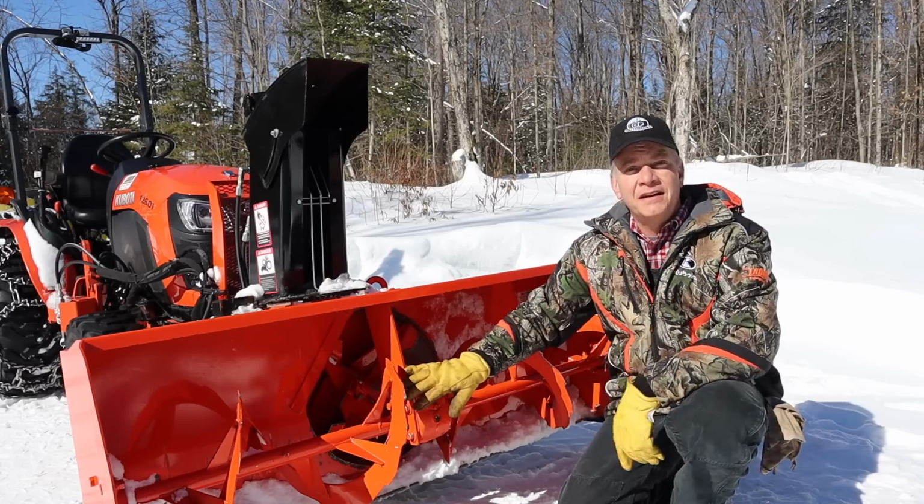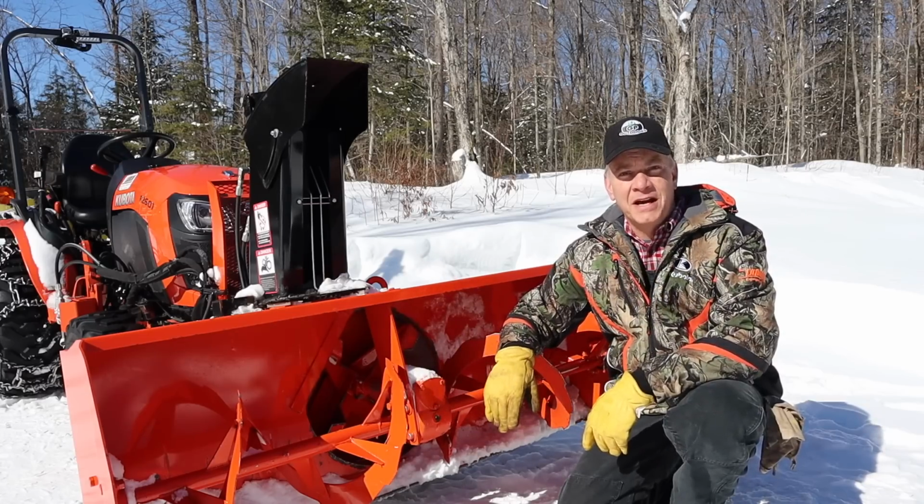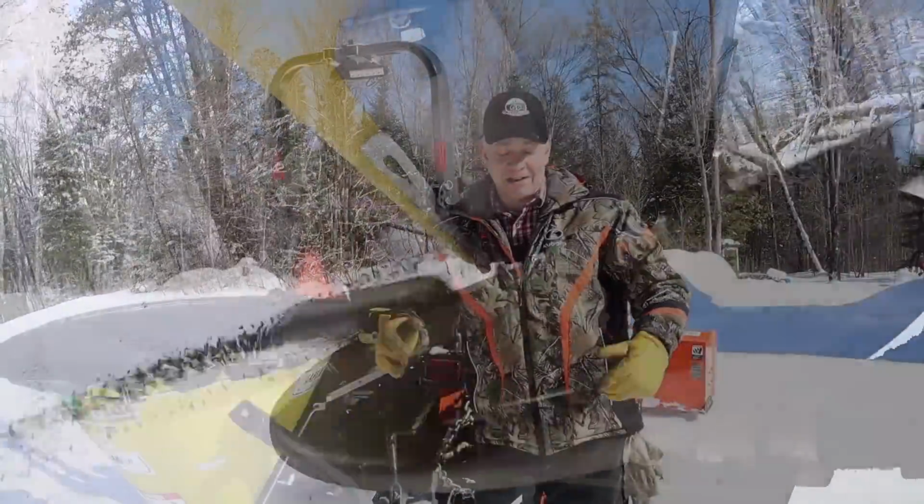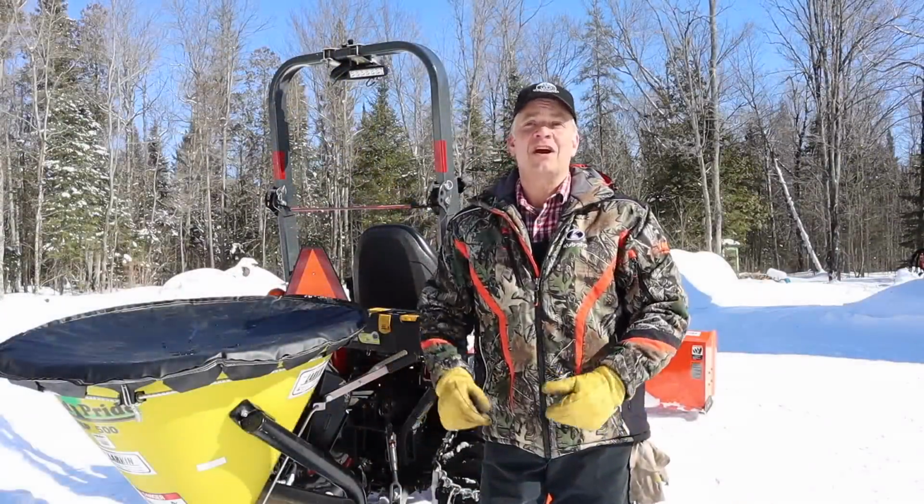And I was pretty excited the day I brought it home and hooked it up to the back of the tractor. But that excitement petered out pretty quick. After I'd filled it up with sand, headed up the driveway, turned up the PTOs, revved my throttle up to my 540 position, I found I was sending sand 40 and 50 feet into the forest instead of 6 or 7 feet into the driveway behind me.